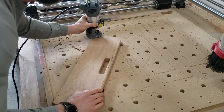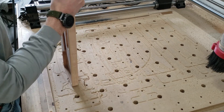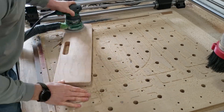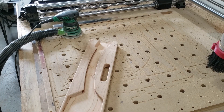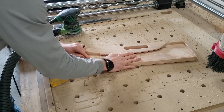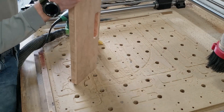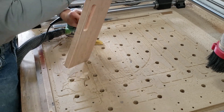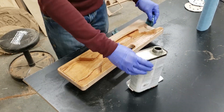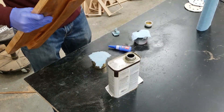After that, I throw on some 220 and everything gets a good sanding with 220 on the orbital. Sometimes I have to go down to 120 grit to get any scratches out. You want this thing to feel really nice in the hand. Then I use some micro sanding pads to hand-sand everything that didn't get touched with the orbital — get rid of any lines and go over all the edges to make sure everything's smooth. When you're done sanding, you can put it in the laser. I've already lasered this one — I included this file with the package you guys purchased. Then I just use natural Danish oil, rub the piece down, and let it cure overnight. It has a little poly in it so it cures fairly hard — a pretty durable finish. Feel free to use whatever finish you like, but this is what I like and it's pretty easy.